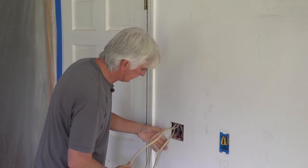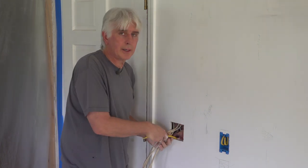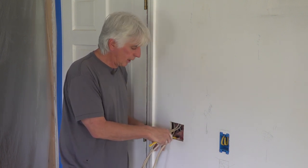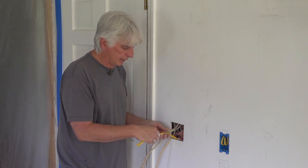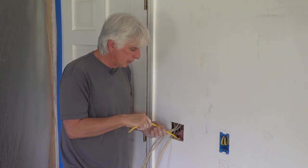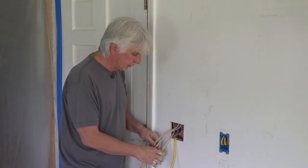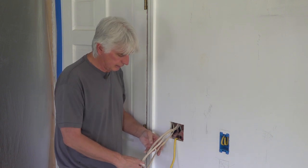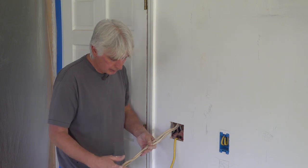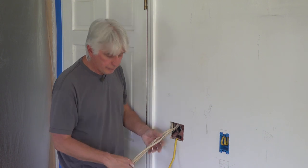When this house was wired, they had 14-3 run on a circuit that also had 20-amp wires, and it was run in 20-amp — you were allowed to do that back then, but now you're not. So if it's existing in the house, they can't make you change it as long as you're not doing anything to it. But we're going to go ahead and change this since we have access to it. So this is a 12-3 — it's yellow. They didn't used to color code the wire; it used to be all white, both the 12 and the 14. So this is all 12 here, even though you would think by looking at it that it's 14 because it's white. It was actually 12 back then, and this is 12. Now, 12-2 or 12-3 is yellow, and 14 is white.